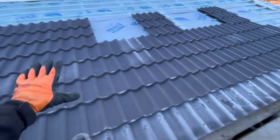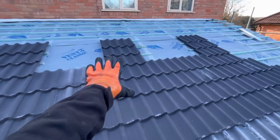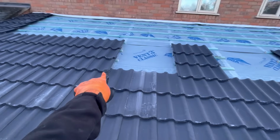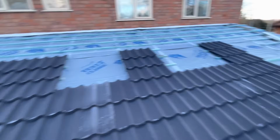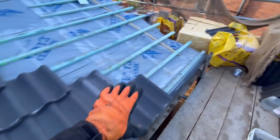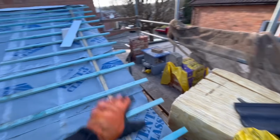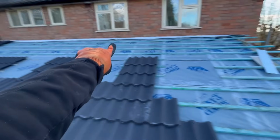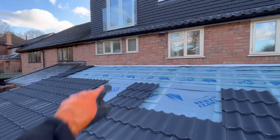So we've done as much as we can now. These tiles are in, full tiles. We've got cuts to go onto here to go into the velux. We've got cuts to go underneath there to go into the velux. Likewise there, likewise there, likewise there. This is all racked back, ready for the brickwork. And again, we'll leave this now because we need to have our way to walk up there and across to the platform for when we start working on that.